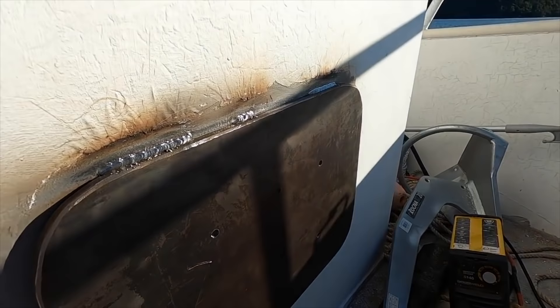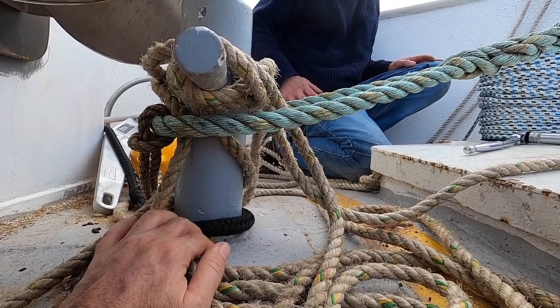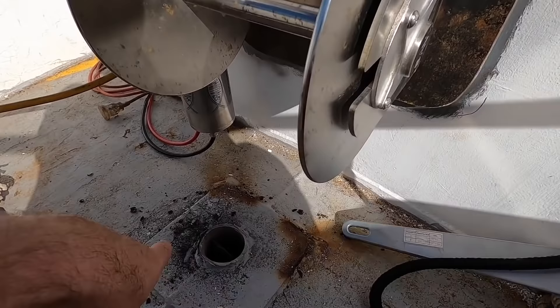This is the clearance we need — see how this comes up and ends up inside the diameter of the drum. I am tempted to actually cut it right off, then cut the top off in the workshop. We're going to take the winch off the bulkhead again so we can weld round. I'm pretty happy with where it is, and it'll let us get the needle gun in here and get rid of all this rust. No assistant today, so I'm going to have a go at cutting it myself. It's still sore, can't bend it much, but it's been a month. So I'll weld it on first, then we'll put primer on it — otherwise it's just going to burn off again.